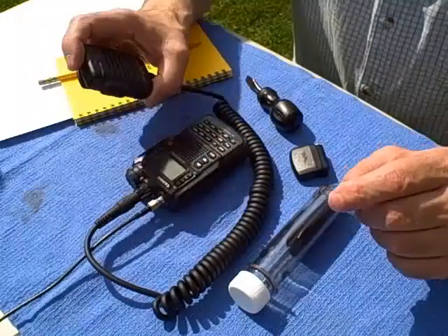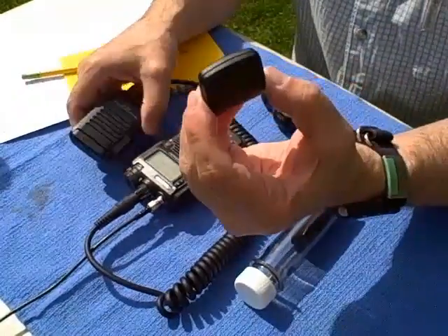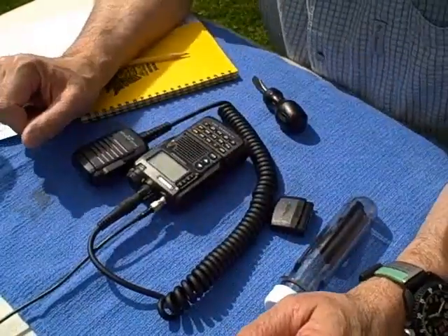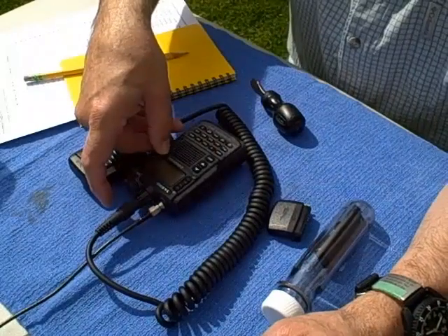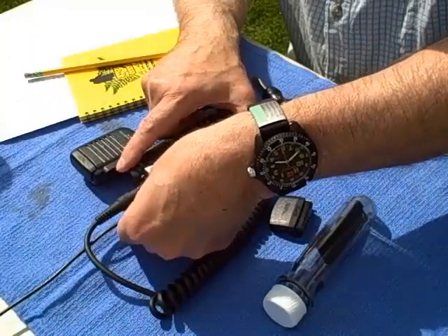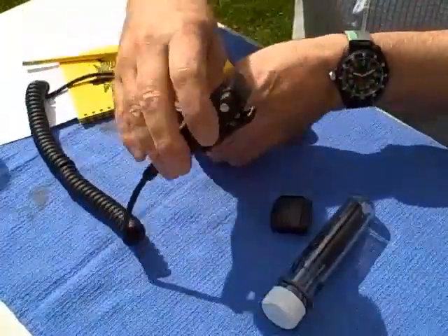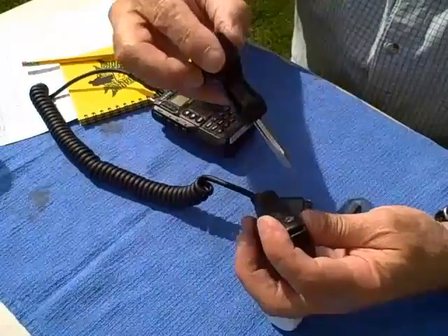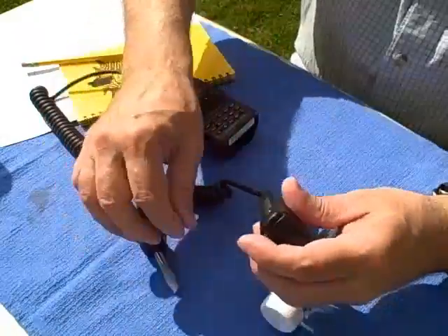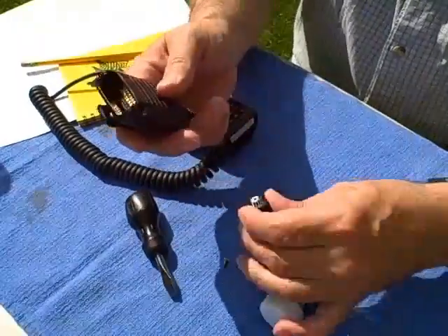A little noisy here, but I'm going to modify my Yaesu VX8R with a GPS antenna that mounts on the top of this microphone, and that will allow me to enable the APRS — Automatic Position Reporting System — on the radio. And I can view that on the internet. So I'm just going to disconnect here so I can have access. Basically you just remove this screw, it's pretty simple. And I keep this little screwdriver in my radio bag, so if I need to make any adjustments on these pieces, I've got that screwdriver available.